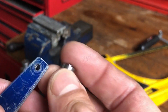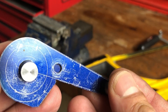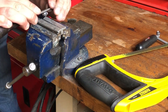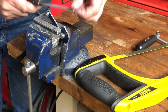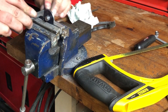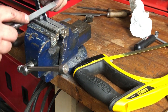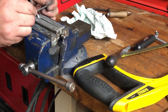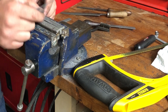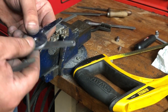For the small radius I have made a filing button of the correct size that will sit in the one-eighth hole, and I will just complete the larger one by eye. It is now just a case of filing these down to the lines, taking care to keep the edges as square as possible, and keeping an eye on the location pins that constantly fall onto the floor. Hemingway kits sell a die filing attachment for the lathe that would be ideal for this, and I've been looking at it for a while. If anyone would be interested in seeing me make one of those, please do let me know. With the shaping complete, I'm just touching the edges with a stone to soften them, and we are ready for boring.